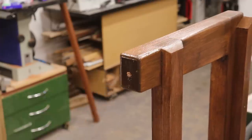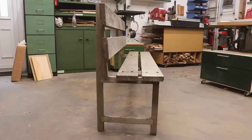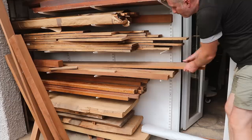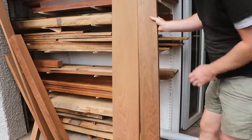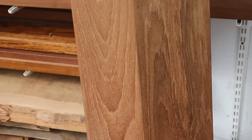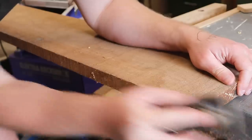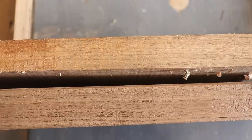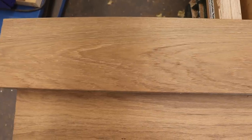To protect the end grain from sucking up moisture from the floor I'm also going to add some plastic feet to the bottom of the legs. There were only four slats on the original bench and I really wanted to add another to make the seat deeper. I have some Iroko boards in storage but they weren't thick enough and weren't a good match for the teak. I did have some rough sawn Iroko which was a little bit thicker, so I planed that down and the colour appeared to be a much better match — not identical but probably my best option. When I ran it through the planer this time I didn't get that leathery smell, and when it came out it looked like about as close a match as I could have ever hoped for.